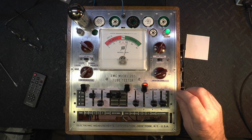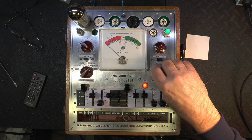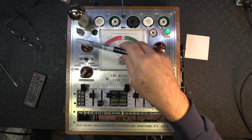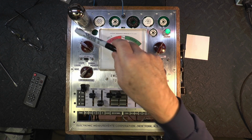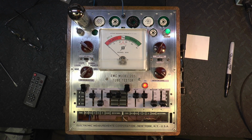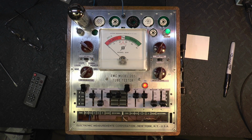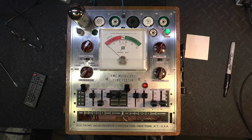Now we go for the noise. Take the input off the oscillator, we put on the AGC, and there's the gain. And there's a little bit of microphonic, but that's a lot of gain for this. You don't hear grids bashing into each other and stuff, because the power tubes really don't have a lot of gain in comparison to the 12AX7, so there is a lot of gain here. That's the 6L6. We'll turn off the plate voltage and we'll try a different tube now.